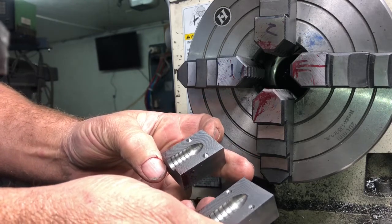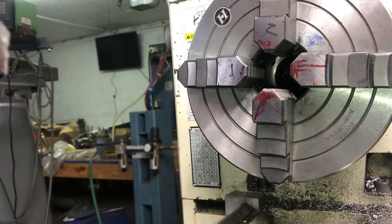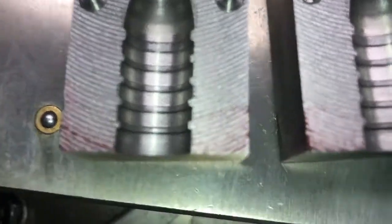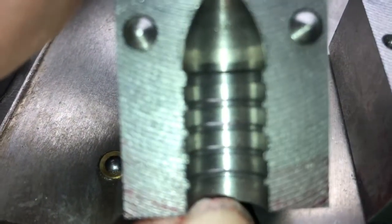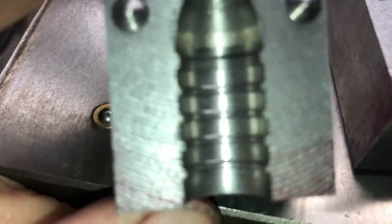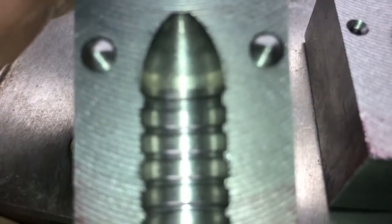I like it — I like it a lot. Let's pull the camera up and take a better look at it. You can see that the top lube groove is a little thicker than the rest of them — quite a bit thicker actually. I cut that tool that I bored the grooves with on a 20-degree angle. I would have liked all the grooves to look more like that top one, but they didn't. The bottom of that's pretty even and I think it should shoot okay.